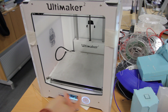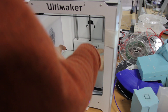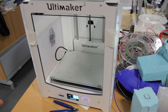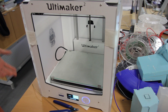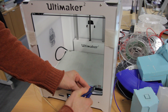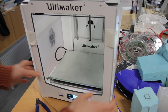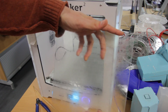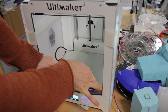Alright, here we are by the printer — printer's finished. There's the plate I've just done. I've taken it off and I'm just going to slide it back on and clip these things down. Now I'm just going to kick a print off. If you have a calibrated printer and you don't move the platform too much, you don't need to calibrate it every single time like some people think you do. Just take a bit of care taking it off. I use these pliers to just open it that way, open it that way — they are kind of sharp, it would've been nice to have some silicone pads on them. Then you wobble it left and right, take it out, put it back in, close it — done.